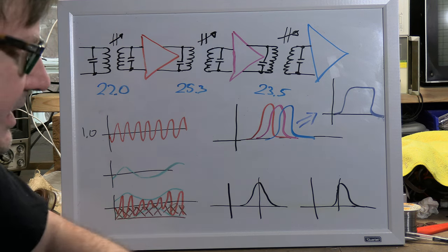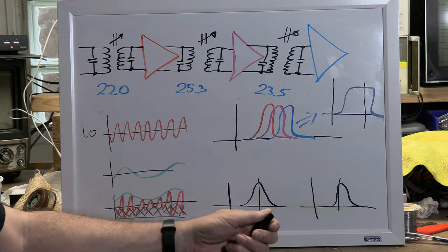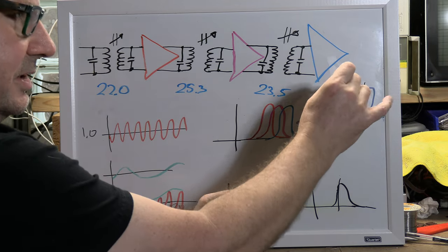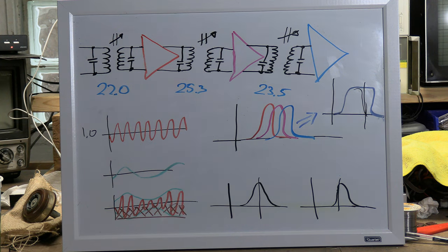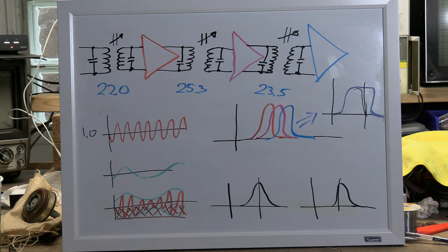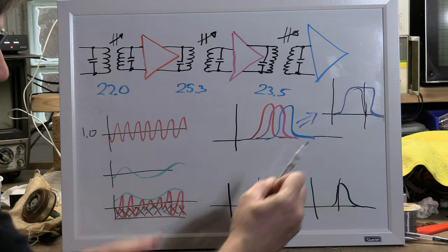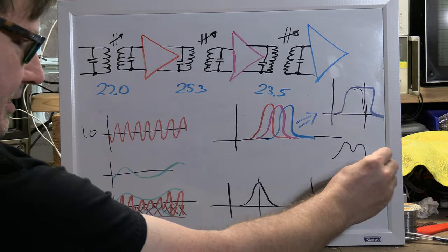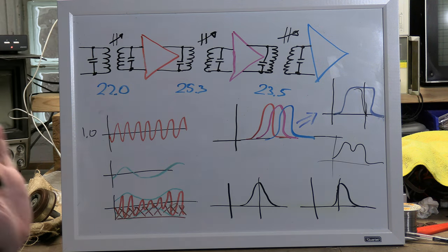So they took off a chunk of this, about a 1 megahertz slice, devoted it to color info, which meant for the actual image, the luminance, they shrunk the passband. Meaning instead of having 3 of these lumps, you could get by with 2. It wouldn't be ideal. Often the response curve on those, instead of being this perfect flat top plateau, is more like a double hump. But for most viewers, it's good enough.